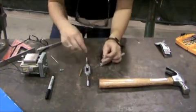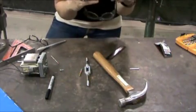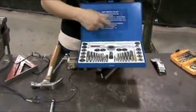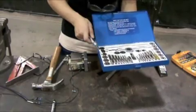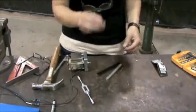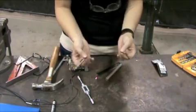Measure that out and use the nail again to make a dent. The hole that's going to be drilled right there needs to be pretty specific. I'm going to be using the tap and die system — basically just tapping right now. These are taps, these are dies. I'll be using a tap that has the size I need, and it correlates with this bolt which I will be using. There is a chart that tells you what size drill you need to go with which size tap, and these are the ones I'll be using.